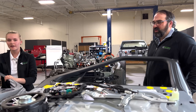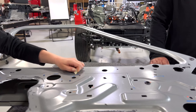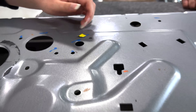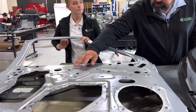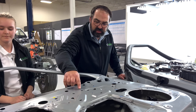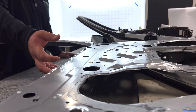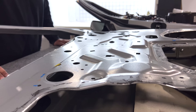There was also a welding issue on the driver door — a small piece of tape covering a spot where the weld gun got too close and burned through slightly. That same issue appeared on the rear left-hand door, where there were two additional welding issues. There's a weld holding a reinforcement for the top of the door, and you can see lines running across the doorframe from the inner side where it was welded. In one spot it sat too long, got too hot, and burned through.